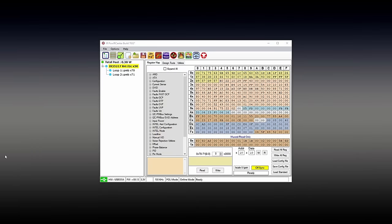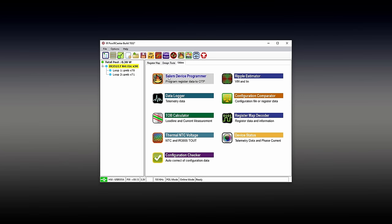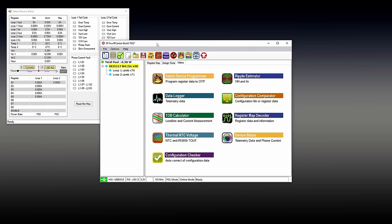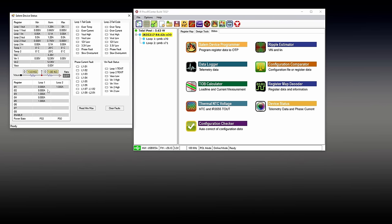I connected the dongle to the graphics card and now we can monitor the power delivery. If there are any problems with any of the phases we can monitor while running some kind of a load. I'm going to run the load — I'll run Valley and monitor the temperatures to make sure we do not overheat. We're still at 492 megahertz. In here everything is looking good. Let me go ahead and run something a little heavier.